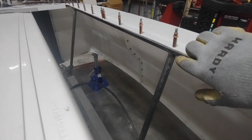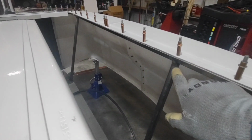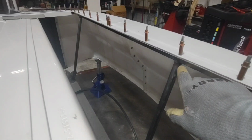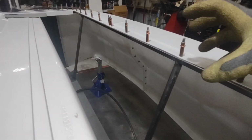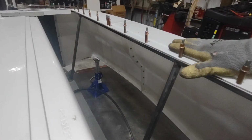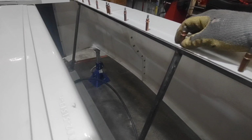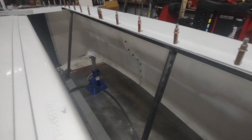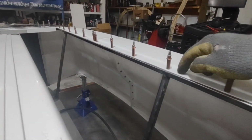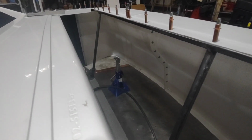Two, if you can't remove that, take a wet rag and keep it in a bucket of water, so when you weld this, you weld about 1/4 of the way around or 1/3 of the way around. Take that soaking wet dripping rag and wrap it around that and cool that, and then while you're welding, keep it on the top surfaces to keep this plastic cool. You can even pull this cleco out, give yourself a little bit of room there. Whatever you got to do just to make sure you don't distort this plastic bumper. Now, like I say, I'm ready to move forward.